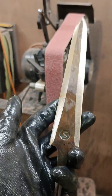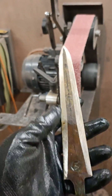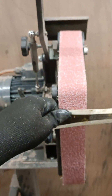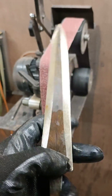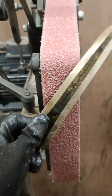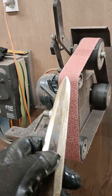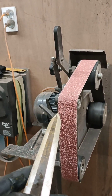This is a feather Damascus knife I'm working on. I suggest if you're getting into double-beveled daggers or double-beveled anything, this is how I would approach the bevel grinds. I used to grind a lot at 90 degrees, which is fine if it works for you. But I struggled with it, so turning to 45 degrees, increasing the surface area of the grind, and giving myself a better ridge line to develop — that's what works best for me. Thanks to Sky for setting this in motion, and I want to put more videos out for the maker community.